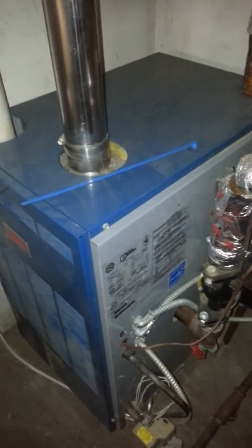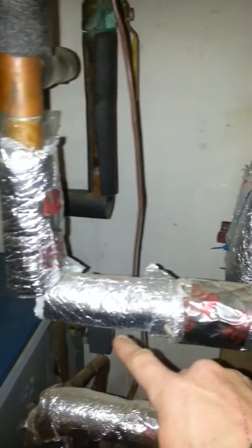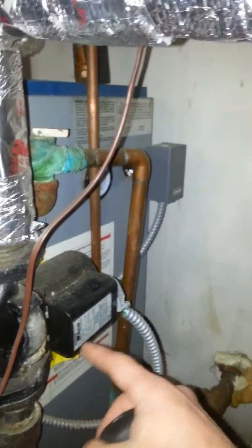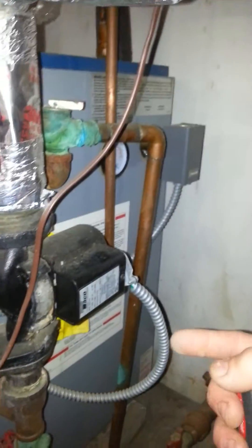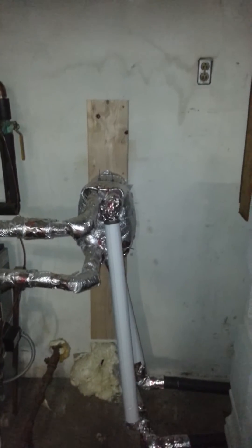That out there is controlled separately from this boiler. What happens is the water is exchanged in here and heated up — these two systems are separate. Here's my water boiler, a Utica water boiler, good to do up to 4,000 square feet. The return line normally would just go right back into the boiler, but in this case I looped in this brazed heat exchanger. The water goes in, transfers and picks up the heat from the wood boiler water, and returns back into the Utica already at 170 degrees — therefore the LP never kicks on. These two separate systems are looped through the brazed heat exchanger, exchanging heat, but the water systems never touch.